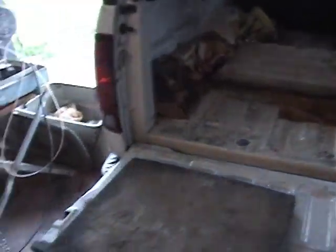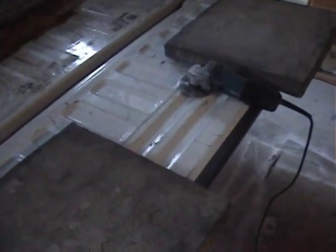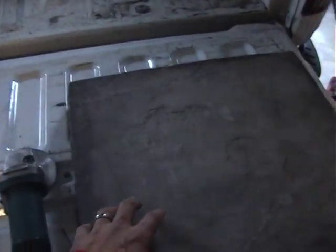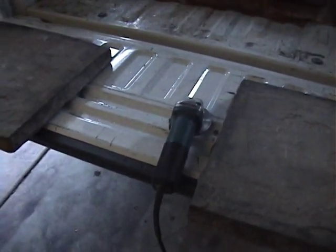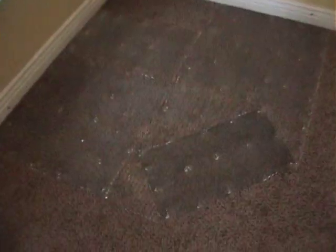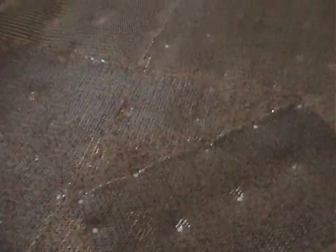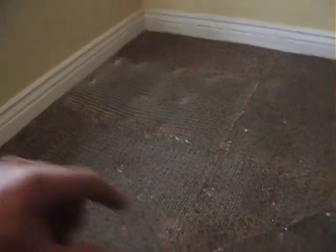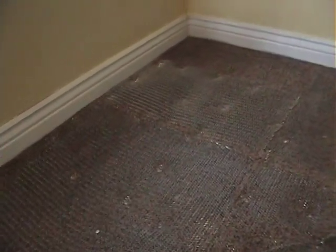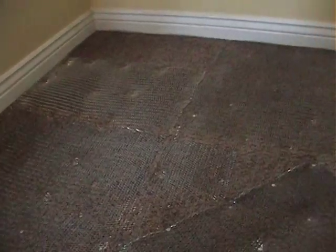I've got some metal lath here. I just nailed it right to the floor of my house — I've got a subfloor — and I nailed it right over the carpet. So I've got these hearth stones, and we are going to install a hearth pad for my wood burning stove. I've already nailed down the metal lath and it's pretty tight — I've doubled it up — and we are going to put about probably a good ½ inch, maybe ¾ of an inch of that Type S mortar, and stick these stones down just like you would a ceramic tile.